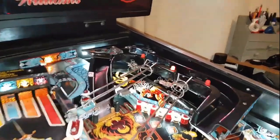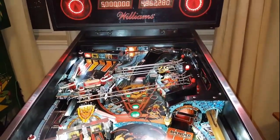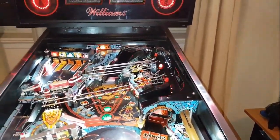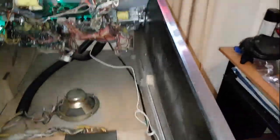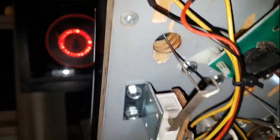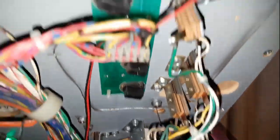It's been about an hour - took my time and it looks great. I had the strips higher at first but then I tucked one a little behind the ramp since that side already has enough light. Both are frosted. I tied the red wire all the way to the GI on the right side - nice solder joint - and the other one tied in to the GI on the left side. I put a wire tie so it doesn't trip up on any switch. Looks great.